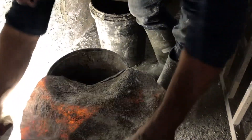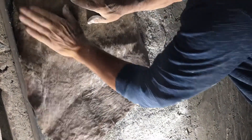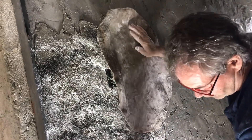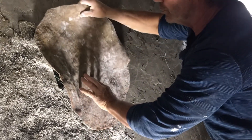Now I'm going to stamp that, so I'm putting the white cement on here instead of a release agent. Here's where my old joint was, so I'm going to go over it again. I like having these big mats because they don't show the edges as much — sometimes you want edges, but in this case it's going to be a single surface. What I like about this is you can make these seams join up really nicely. Even if you came back the next day, you can still make it look real and join up the seams.